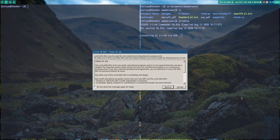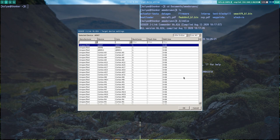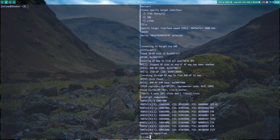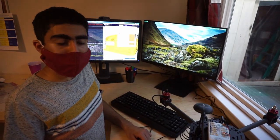Type J-Link EXE to connect to the J-Link Mini programmer. If prompted, update the programmer's firmware. Then type connect into the prompt, followed by a question mark to select the target device. In the target device settings window, search for MK66 and select the MK66FN2M0XXX18 with 2MB flash option. Type S and enter to select the serial wire debug interface, then hit enter again to accept the default interface speed. The programmer should now connect to the FMU, and you can install PX4 onto this board.